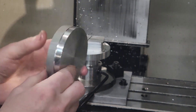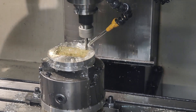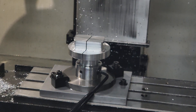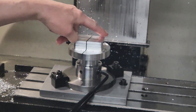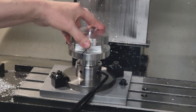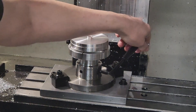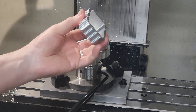So this is how I went about it. I initially turned up an aluminum blank billet and then put it in a three-jaw chuck and milled the internal. I ended up with a part that looked like that. I then milled a 100mm adapter on my Flexi Chuck to the internal profile. I can then place that over the top, clamp it up, and now I'm ready to mill — and we end up with a finished part.